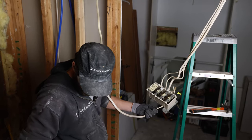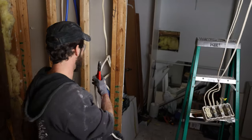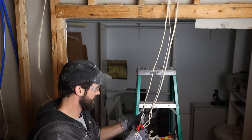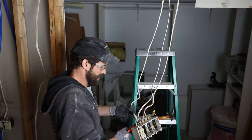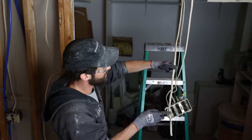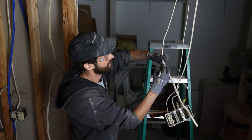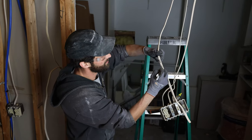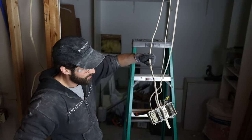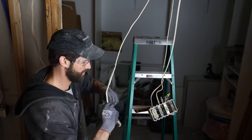I'm going to snip all this out of the way. We're not going to take the time to disentangle each one of these switches — we know the purpose of the wire. That's a hot feed that we need to refeed. This one right here is going across the ceiling and down the wall, feeding a receptacle, so that needs to be a hot. I'm going to cut that loose, and before I let go of it and lose track of it, I'm going to label it up above — I'll strip that 10 to 12 inches back at the end. Label this hot. I'm going to confirm that's the closet plug — closet receptacle. We don't want to operate on assumptions. Let's strip it back and put a tester on it.